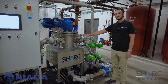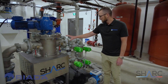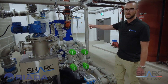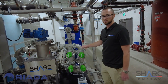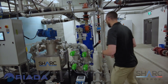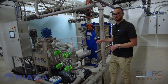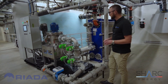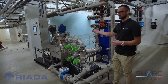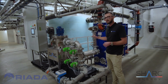Anything that makes its way through the filter basket with smaller than three millimeter solids comes through these auto-reversing valves and through a wide-gap plate heat exchanger — a specialized heat exchanger that can accept up to 11 millimeter solids. The valves will automatically reverse the flow through the heat exchanger on a scheduled basis to reject any potential stringy solids that might make their way through the filter basket, keeping the heat exchanger nice and clean.